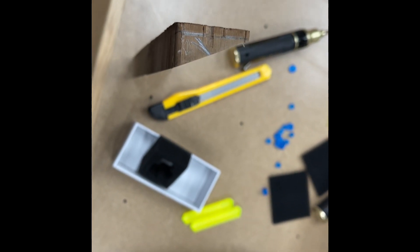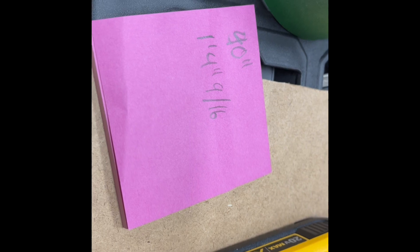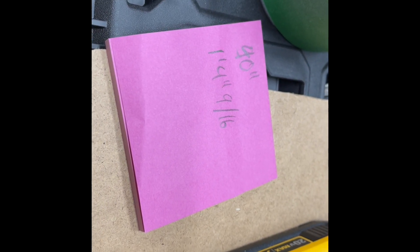When I looked at all the calculations I'm going to need just over one foot - I think one foot nine inches. Let me find the little sheet of paper over here. By the way, I have horrible handwriting. It's one foot four inches and nine sixteenths, so if I do one foot five inches I'm going to be pretty close. If I do one foot five and a half inches I'm even better. So it's going to be basically one foot five and a half inches, and that's where I'm going to set my stop block.